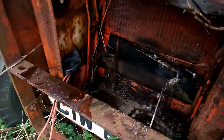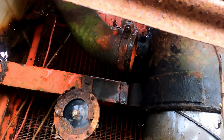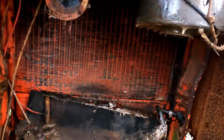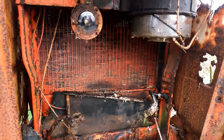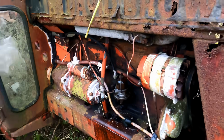I've got the battery removed and I've disconnected the pipe to the manifold, but there's a lot of oil in that pipe, so I might take off the opposite end of it as well and just make sure. I suppose it probably just overflowed up the start of it when that filled with water. But with a diesel engine, you just don't want large quantities of oil where it can get ingested, cause the engine to run away.